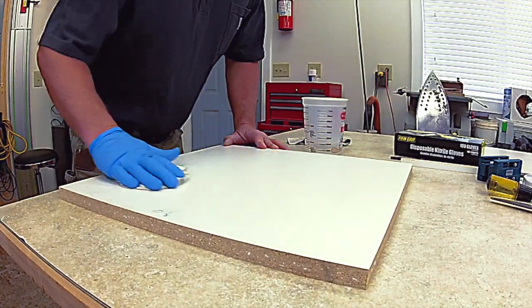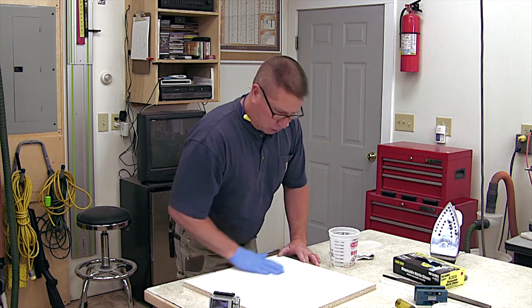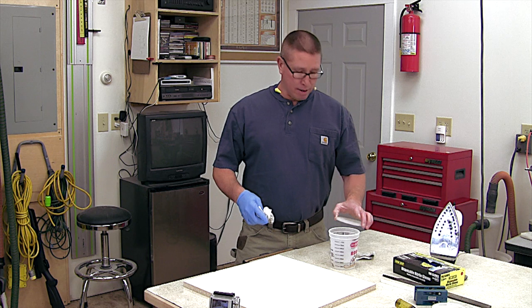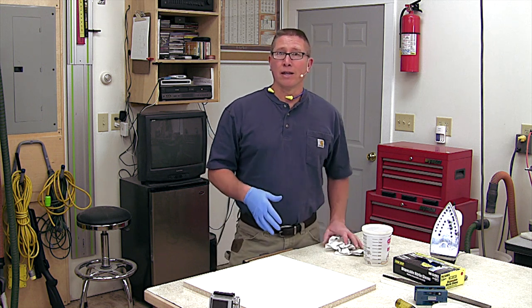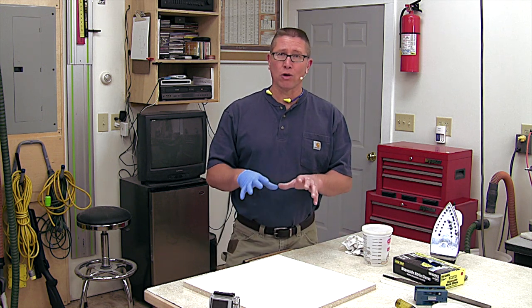And I'm just cleaning it up because it gets smeared the more I push it around on the table saws and everything. But sometimes I'll write my notes on, and halfway through I might have to clean it up and redo some of the specific notes. If I put a piece of tape, a lot of times I've had the tape catch on the edge of the table saw as I introduce the board to the table saw, and the tape catches in it. It causes that little shift, and then that disrupts the smooth, even feed rate that you want to create when going across the table saw.